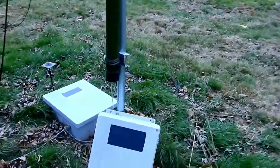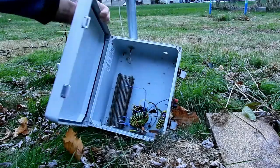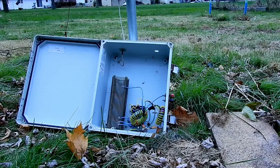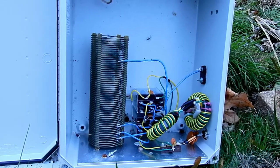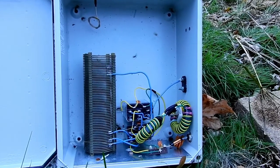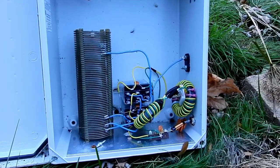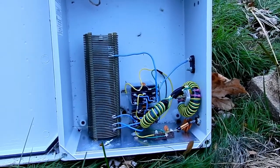Right here is the first match box that I had made for this antenna. This is not my design — I found it on the Alpha Delta 5X website. He's got a real nice article and presentation on a tuner box. You can see it's got a fixed inductor in there, and it's got a balun and also a 4-to-1 transformer. There are two pretty heavy-duty relays in there and a DC bias circuit. It's fed voltage over the coax, and depending on whether you feed it positive 12, negative 12, or 0, that decides which relay or combination of relays is actuated. It's got a setting for 80 meters and 40 meters, and for the rest of the bands you just use the tuner in the shack.